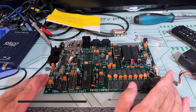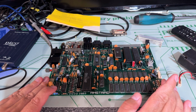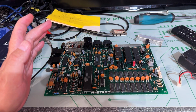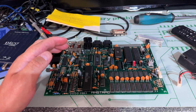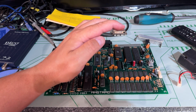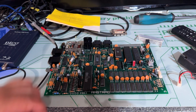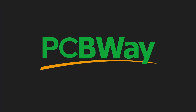In the last video about this machine, I actually didn't try to do a repair attempt as such. I was just checking out what was wrong with it. And in fact it had just a black screen. However, there looked to be normal signals on all the chips and things like that. But I found out that there was no 12 volts provided to the motherboard, and I figured out this transistor here, I think it was this, was faulty and thus did not produce any 12 volts.